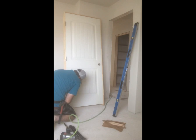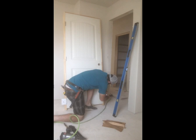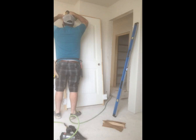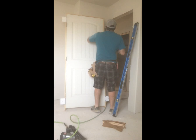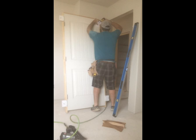What I do when installing pre-hung doors is make four-by-five blocks with three screws in them. I scribe a line 5/16 off one side, put two screws on that line top and bottom, then one screw in the middle on the other side — they form a triangle. The two screws go into the side of the door jamb and the one screw goes into the framing around the door.